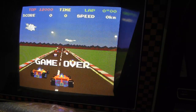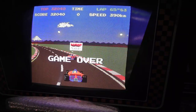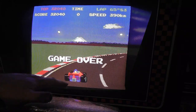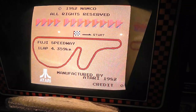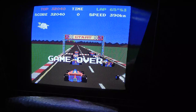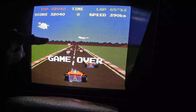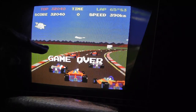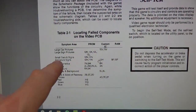The key is describing the behavior. In the manual it says large cars and small cars. The graphics issue is in the small cars. The large cars — no lines up close — but as the cars get further away and smaller, you see horizontal lines going through them. So it's definitely a sprite issue, and it's telling us that's the small cars.